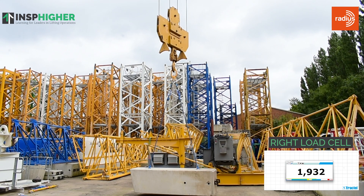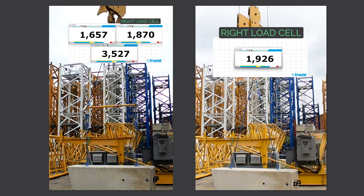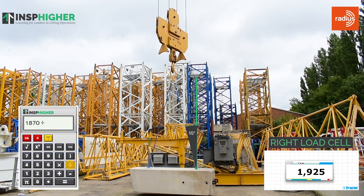What we have here now is the load lifted on an angled arrangement, and the angle is approximately 30 degrees included — therefore around about 15 degrees from the vertical on each leg. If we look at the tension in the leg, using the right-hand leg as the reference — that started off at 1,870 when the leg was vertical — we've now got a load of over 1,900 kilograms at 15 degrees from the vertical. When we do the calculation for this lift, we're doing vertical tension divided by cosine of the angle from the vertical. So in this case, 1,870 divided by cosine 15, and that gives us 1,935 kilos — approximately what the load cell is showing us.